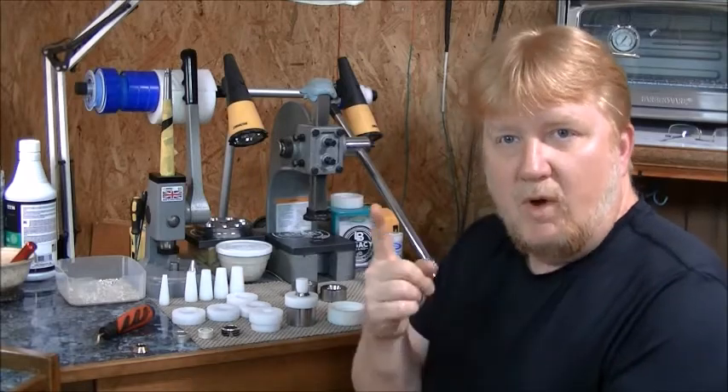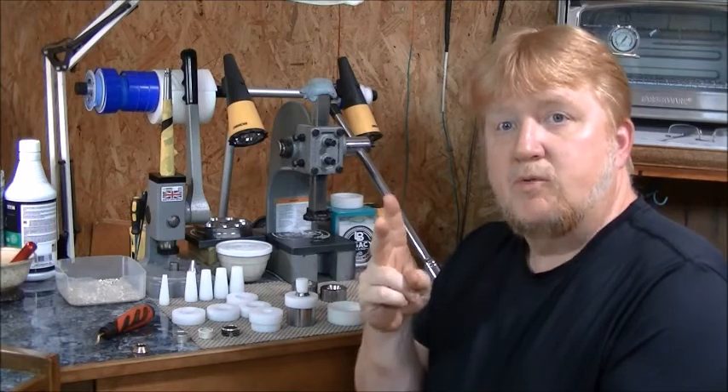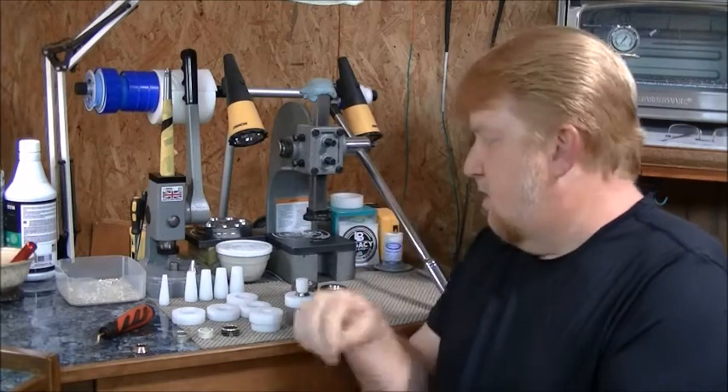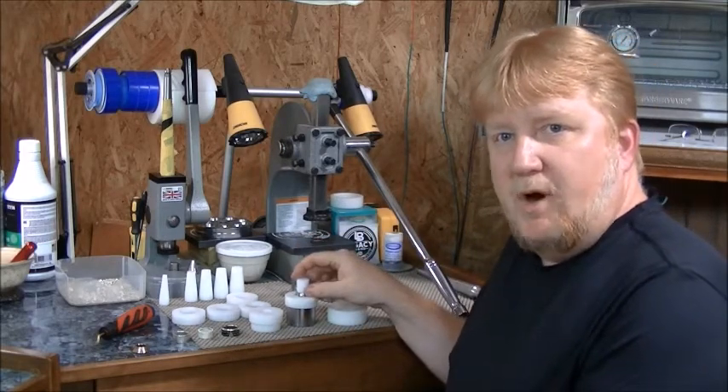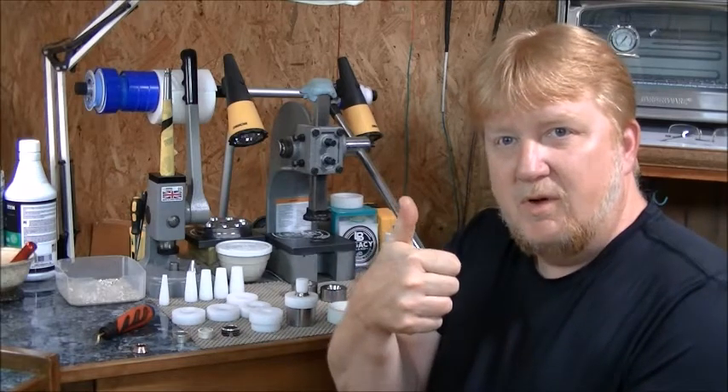Five simple things to remember with this set to be successful. Number one: always anneal your coin rings. Number two: always lubricate your cones. Number three: always deburr. Number four: size up the reed of your rings prior to putting them in there. And number five: have a good time doing it. Thank you for watching the video today — if you like the video, give us a thumbs up. And if you haven't subscribed, now's a great time to do so. Thank you for watching and have a great day. Happy ringing.